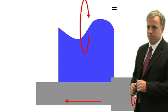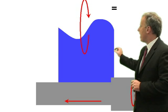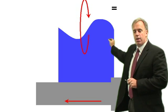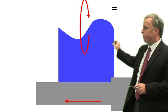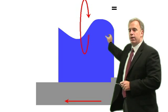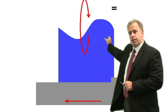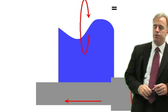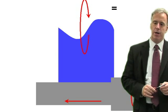That's just too small. If 1% of your wheel is doing the cutting, you have a tiny little fraction doing all the work, and 99% of the wheel doing very little work. So that 1% of the wheel is just taking a beating — removing a lot of material in a really short time, generating a lot of heat, wearing away very quickly, and probably generating grinding burn.